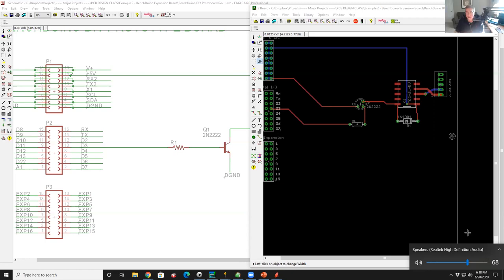Yeah, the biggest learning there was the actual routing of the processor boards was not critical because they're all low frequency. Anything that's like 40 megahertz, like a PIC, is not critical at all. The Raspberry Pi, all the high-speed stuff is on the board. All the off-board I/O is slow. So there was very little that was critical in the routing at all for those boards. It was just general hygiene of keep things spaced apart and make traces big enough. The biggest thought was really in the architecture, which is, how do you come up with a standardized interconnect scheme that could support several different processors with a wide range of different pin counts?